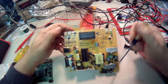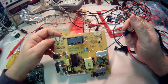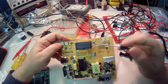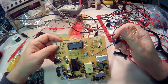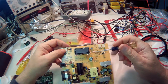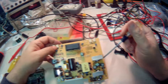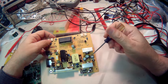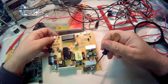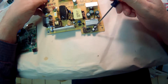Overall, the board looks pretty nice. It's laid out okay — a little separation on the flyback there. That's a 25-volt cap; I'll probably try to find a 50-volt cap for that. Now these caps are not bulging — but looky there, those two caps have got big bulges on them.